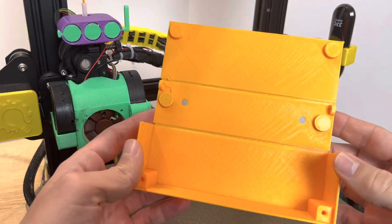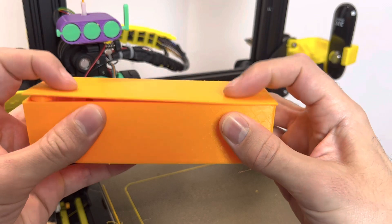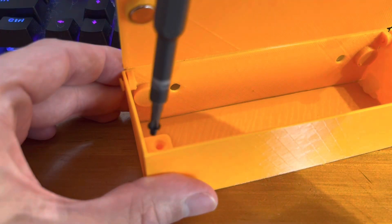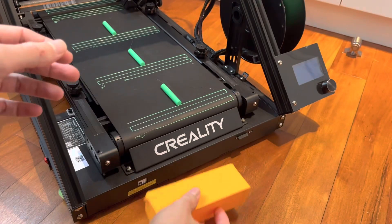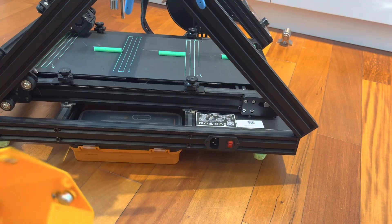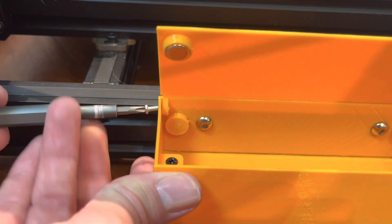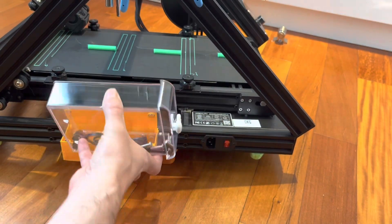For the spare parts, I've been working on this origami box concept. The box lays flat during printing so we can embed some magnets in it, then fold across these living hinges to form a nice box. To keep the box from unfolding I printed little push pins, though the snap-fit lid didn't turn out well so I used super glue and magnets in the lid with M3 screws in the base for a magnetic closure. I attached it to the extrusion frame using bolts and T-nuts for a sturdy connection, and replaced the push pins with M3 screws for a stronger hold.